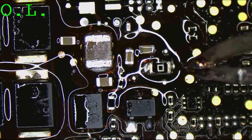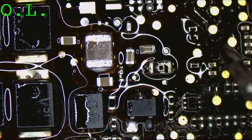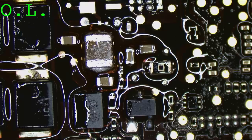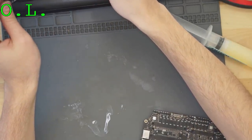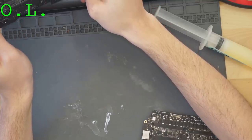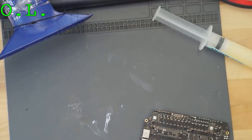Did you remove many more things or is it okay? See, the zero ohm resistor actually works as a fuse, because if it goes over a tenth of a watt, the resistor dies. If you short the pins, you have a one-fire mod. Have this rapidly cool for like 10 seconds. Ready for desk cam, Louis. Rapid cool technology. Patent pending. Okay. Should be good enough. Did I remove anything else? Anything else dead on this board?